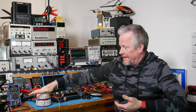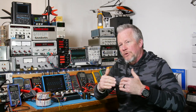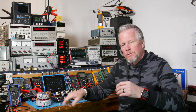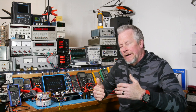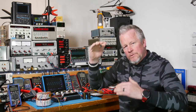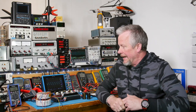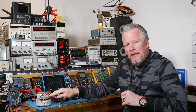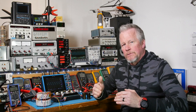Because of the way this amplifier is, this guy still looks like a viable candidate. So let's test this today, and then we'll test the other one. This one should give us two output windings at 22 volts. Once we stack them, we can get plus or minus 22 volts RMS. The peak of that is close to 31 volts, so we get 62 volts from rail to rail with the center tap. This other guy puts out 25 volts RMS on each winding — the square root of two of that is 35 volts per rail.